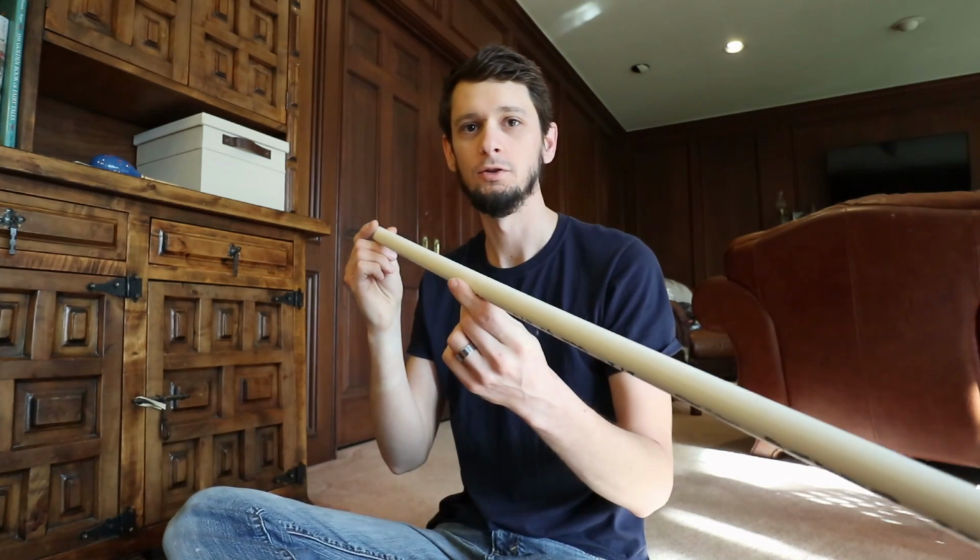So the goal this morning is to take a roll of half inch PEX, and I'm going to use this half inch PVC to index it. We're going to create a just about a 3 foot wide circle, and it's going to coil in and then coil back out. So it'll be two layers. This will allow me to freeze water. So I'm going to run the antifreeze through these coils.